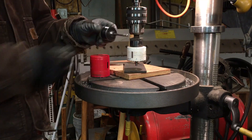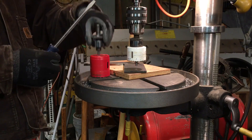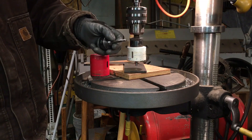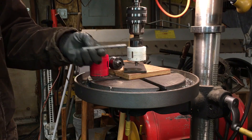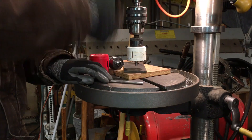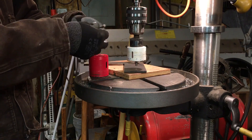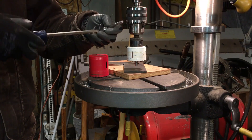So now I just have this quarter-inch rod. If I'm drilling through and it catches and rotates and bends this quarter-inch rod, all I have to do is loosen the screw, take the rod out, take it over to a flat surface — you can do it on concrete, on an anvil, or the back of a bench vise. Take a hammer, smack it straight again. This one has a bunch of marks where I've hit it with the hammer to beat it straight. Then all you do is put it back in, tighten the screw up, and you're back in business.